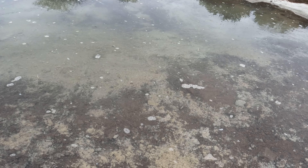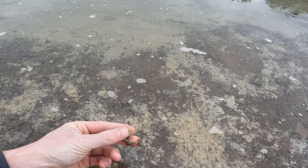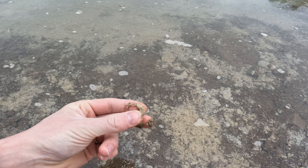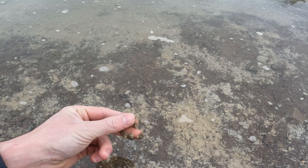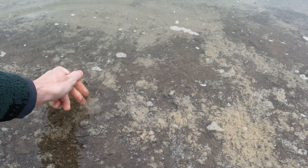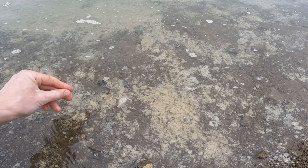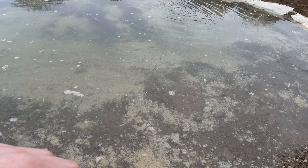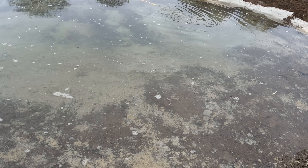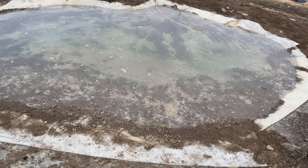So I've started digging this pond, and as you can see, I've just taken out the topsoil. It's about less than a foot of topsoil, and you can tell when I've gotten down to the subsoil when it starts to go with this slight yellowy colour, as opposed to this brown. You can see the difference over here. I've got that subsoil in the wheelbarrow, and that's nice brown topsoil — so there's a big difference between the two: topsoil, subsoil. It's fairly easy to recognise.